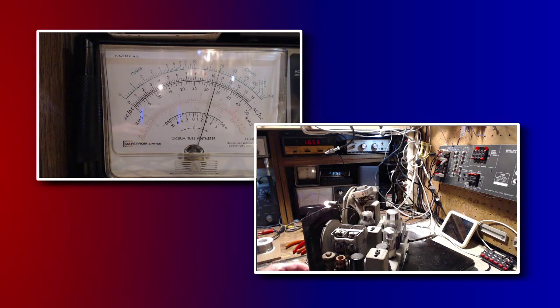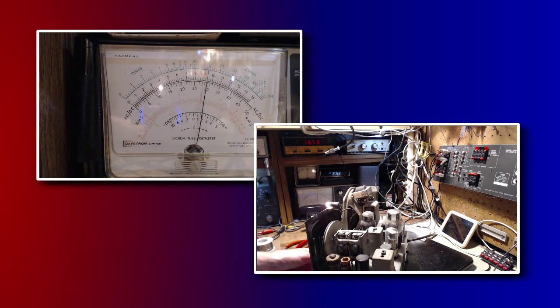So I'm tuned at the top of the band right now, 1730, I guess it is. As I tune down, what's going on here? Okay, we'll switch bands. This is the AM radio band. We have no antenna, of course. Let's put on the outdoor antenna here. 518. Yeah, that works. Okay. You see the AVC working just fine. All the way across. Top end, there's nothing going on.